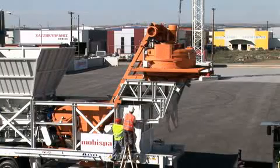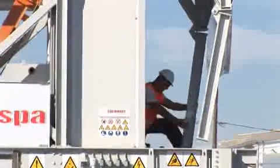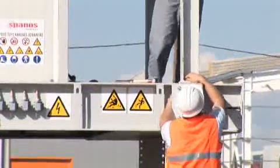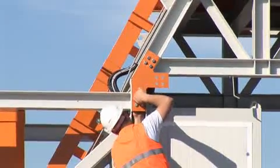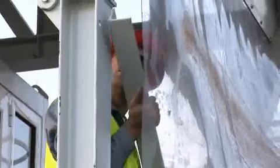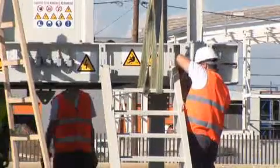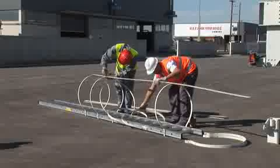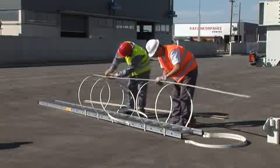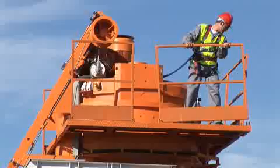Place the floor and fold out the platform legs. Perform all final tightening necessary. The plate secures the lock and must definitely be assembled in place. Assemble struts. Use the stair for access to the operator cabin. Assemble the access stair to the mixer, putting in place all protective arrangements and railings for its balcony.